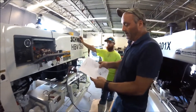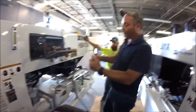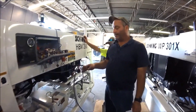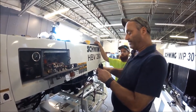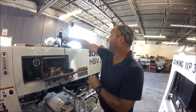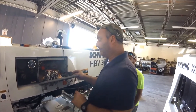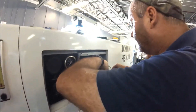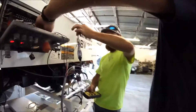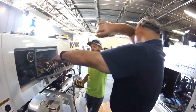If your machine increases RPMs, you hook the violet on positive and then hook your brown up on ground. And then when you increase, it's going to throw power to the tan wire. And then when you hit reverse, it's going to throw power on your pink wire. It's the same as we did for the forward — we're going to do the reverse. So I'm going to energize the gray wire in your momentary switch. Hook your gray wire on the positive side of your toggle switch for pump. And then hook your yellow wire for reverse. Hit reverse, hit off. There you go. That demonstrates reverse and forward.